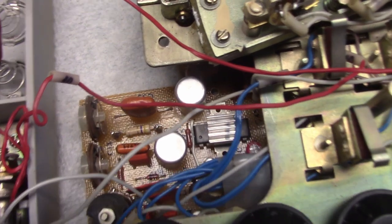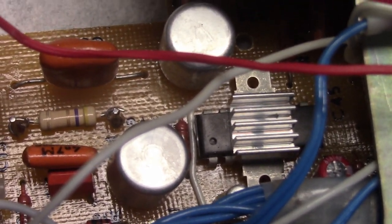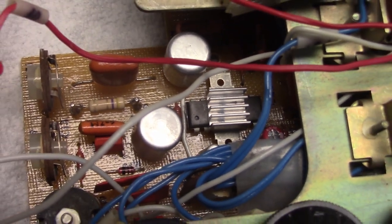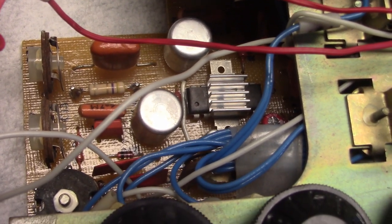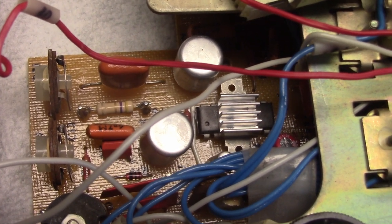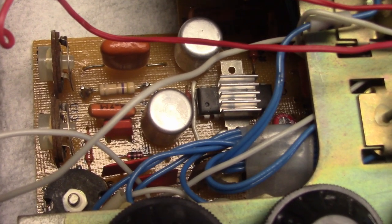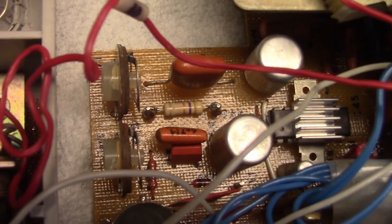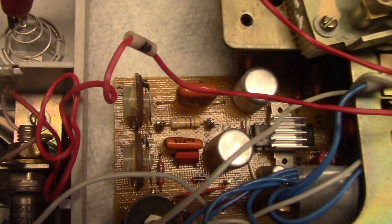Okay. And you can see down here on the amplifier chip, I put a heat sink, because when I first got this, the amplifier chip was getting quite hot. And also, it was drawing a lot more current than I was expecting. I searched the datasheet for this chip and found that it was analogous to the TAA-300, although the TAA-300, I believe, is in a TO-18 or similar package, not a DIP package. But looking at a schematic for a 1-watt amplifier I found online using the TAA-300, it talked about adjusting a particular pot to get a quiescent current of 8 milliamps, and I thought, well, this being similar, there must be a way I can get that current down. So the resistor I saw in the same kind of place, although a very different value, was this one right here. Originally there was a 1 ohm resistor, and I replaced it with a 4.7 ohm resistor, and the current draw went way down.